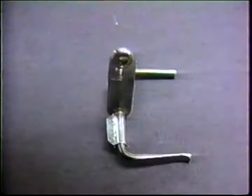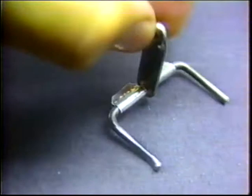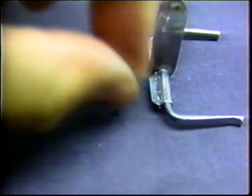Now here's just a couple of things that I do to the horn. Of course, I silver solder in the bushing with Stay-Brite solder. That always seems worthwhile doing. Make these little clips out of tin can stock, just wrap them around and pinch them with pliers and trim them off. That's just going to act as a bearing. And you can see I've taken, now let's see if we can get this on a macro lens real good.